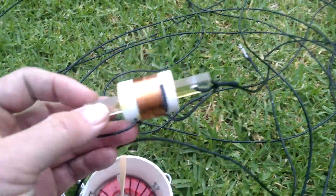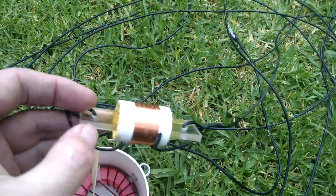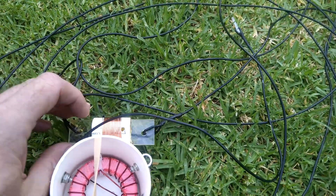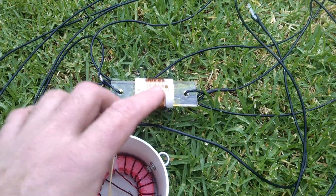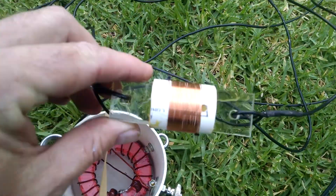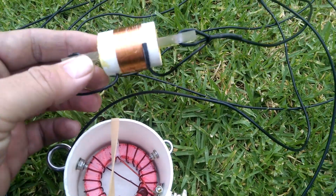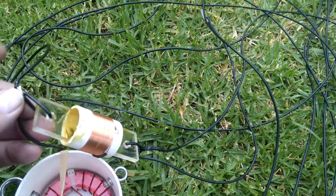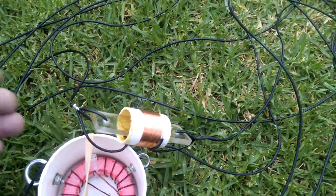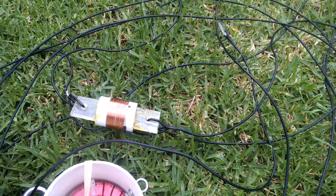The coil is interesting. As you can see, I've constructed it with a piece of 4mm plexiglass right through the middle, and 51 turns of 0.4mm — I think that's 26 AWG — 26 gauge wire. I just kept adjusting it on this side for the 20m and 10m section. The 2 metre piece on the other side of this basically makes it a half-wave 40m antenna.